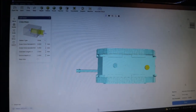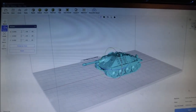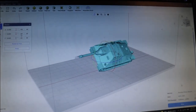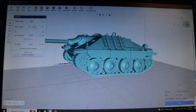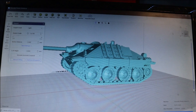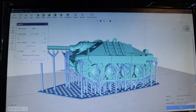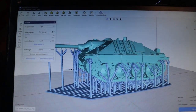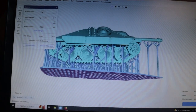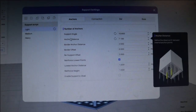If the hollow space is large enough, punch a hole in the bottom and maybe a small one in the top for air to drain resin. Followed by the rotate tool — the Y and Z axis will be slightly adjusted, not to be flat with the surface. This moves the print along the pixels and prevents large objects being torn off the supports. The move tool lifts the model off the bed by 5mm. If your model has a large flat surface, it's not ideal to leave it on the bed as it's likely not to register at the zero layer and can potentially fail or pancake into the vat. I've tried the auto supports and was pretty pleased. Tree supports are very new to me and more efficient, quicker, and waste less material.